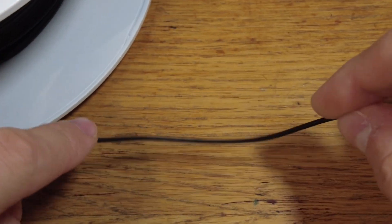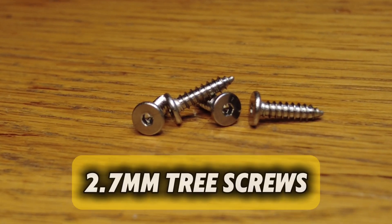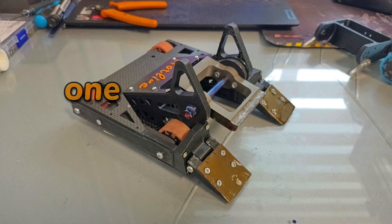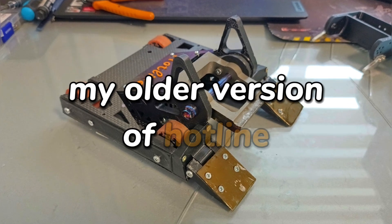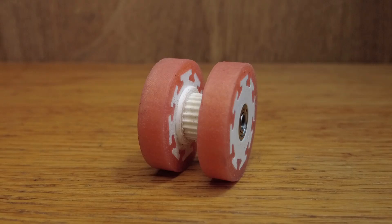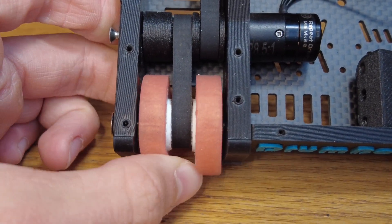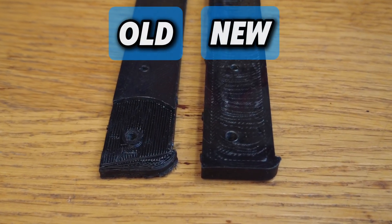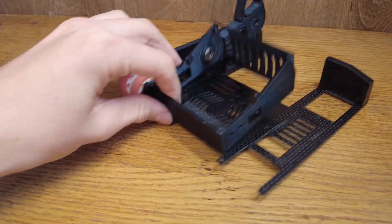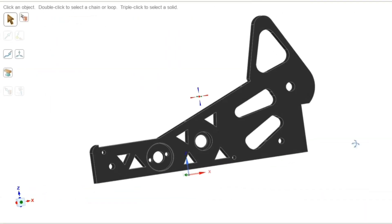Polypropylene is soft, so basic screws wouldn't hold much. For that reason, I used these flat-headed 2.7mm screws, and they attach everything very tightly. One thing we can call stupid about my older version of Hotline was the sides would be very thin in the back — I thought the back wheels would be wider and gave more space, but it turns out I miscalculated and it fits even without that extra space. I changed it to all be one thickness. Same with the main rails. I also removed the big ABS cube that acted as an adapter for the bearing; instead I changed the wall design so the bearing simply press fits into the side.